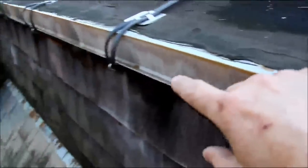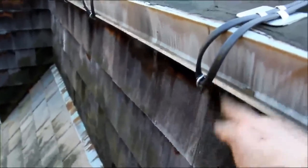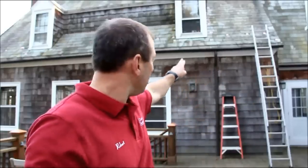For overhanging, we decided to use a mechanical fastener as well — an eye hook — just to catch it over the edge and create that drip edge. We just finished installing the Warmly Yours system on the roof. All the heat tapes are installed and secured. The leads run down the downspout below the deck, where we hid the wires and will place our exterior weatherproof junction box. The electrician is coming tomorrow to power that box and make all the connections.